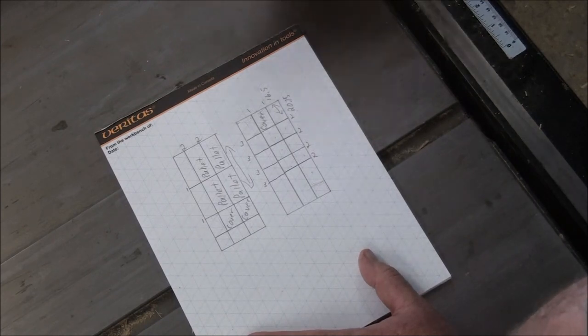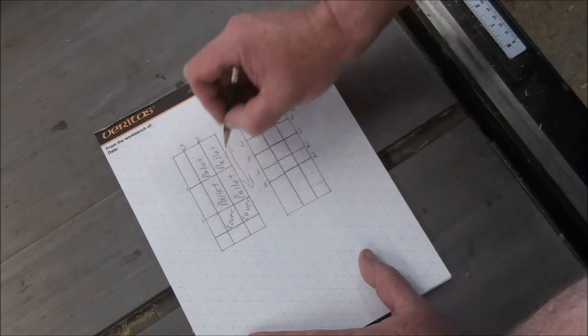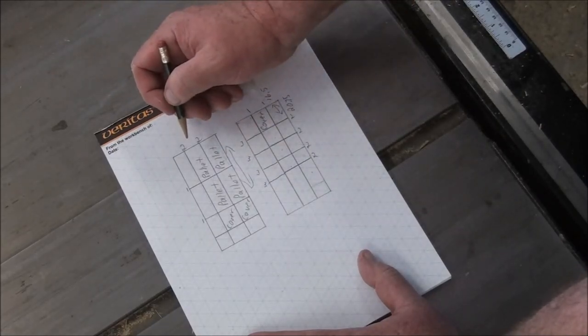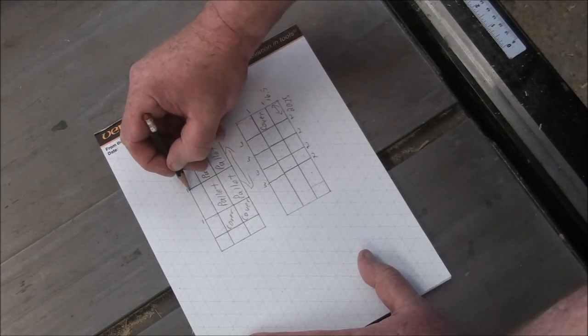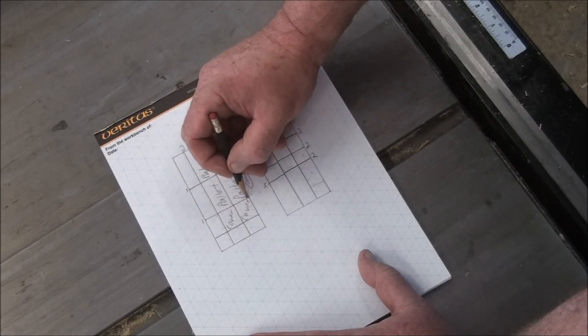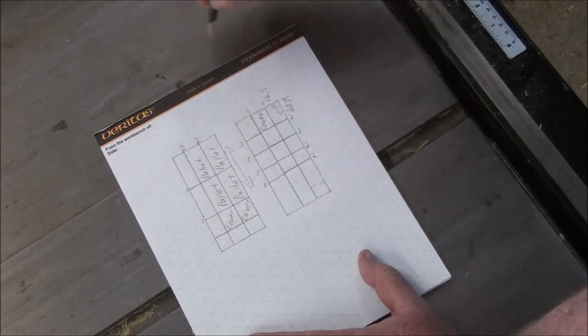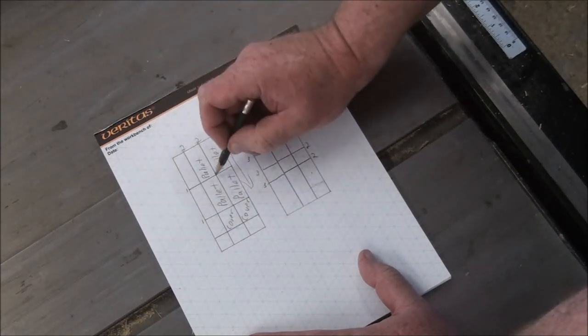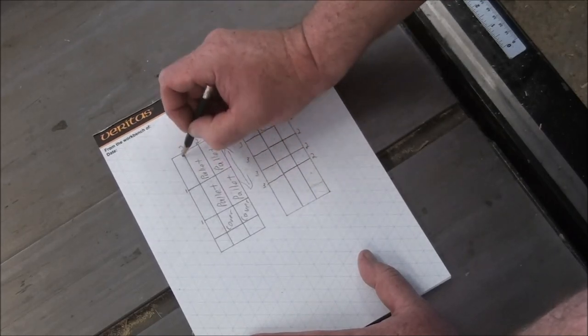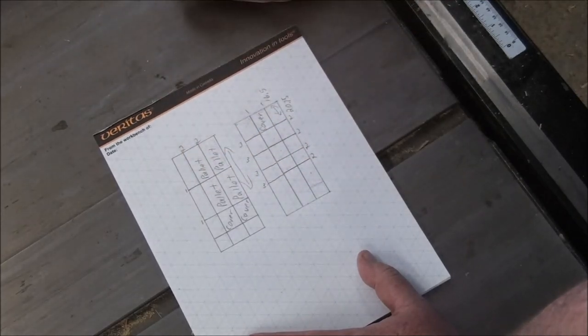But what I've done is I've cut my pallets here. So I only get 4 pallets. You've seen us cutting with the track saw. Our first cut was to rip or cross cut each sheet across this way. So then we get these 2. Then I put this piece up on the table saw and I ripped off a pallet size piece and a spare.